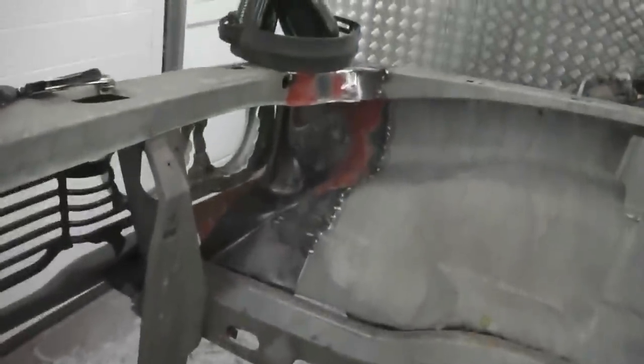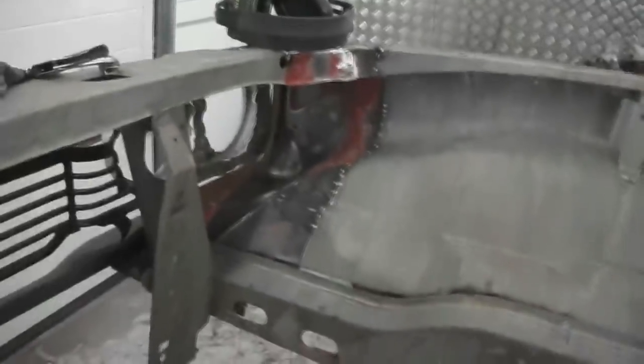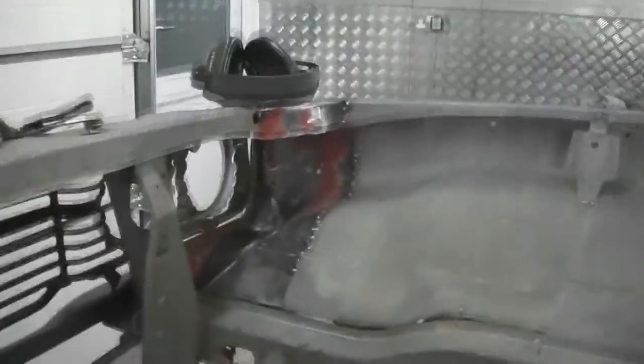But obviously we've got to finish that welding there on that repair piece. So we just keep mocking up, checking, measuring again, checking that it's plumb, checking that it's level. The camera goes on a zoom, I rarely use the zoom. Just showing some of the tacks.